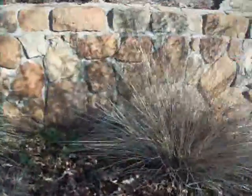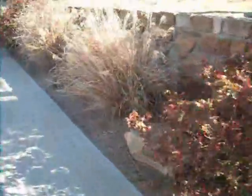So this is the retaining wall at the front. We have drainage here, which is good, and we should be seeing that every 5 to 6 foot. There we go, more drainage there. Yep, we've got drainage into the there in that area. Yep, more. So retaining walls over 4 foot tall, it's about 4 foot, have to be engineered, but there's no way to tell whether it has been engineered or not.